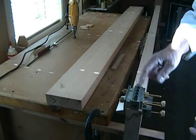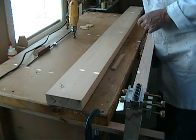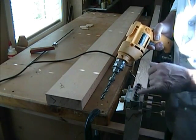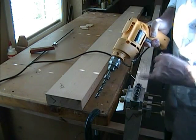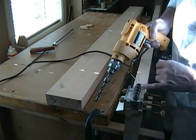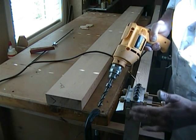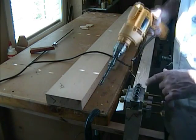We have set the collar to suit two inch dowels — that's an inch penetration — and we're going to avoid the end here. We can use any of these guides, any of positions one to five. But try and avoid using position one, because if we want to dress the end we may interfere with that. So I'm actually going to use four and five.